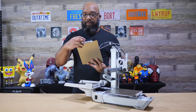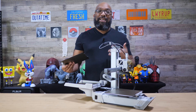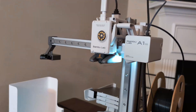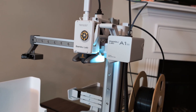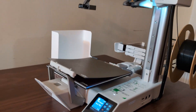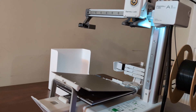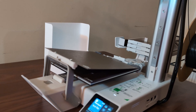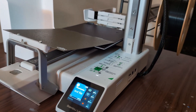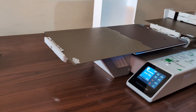What I mean by that is the plates all have this little plastic piece right here in the front, and that is necessary for the ejector in the front to be able to lift up the plate in order to get it off the bed and push it off. This piece also needs to be here for the bed to be able to grab a fresh plate from the tray in the back and pull it onto the bed when you start up another automated print.